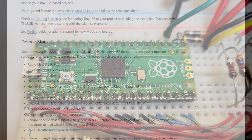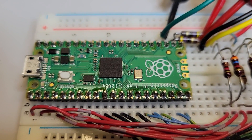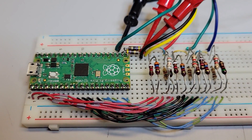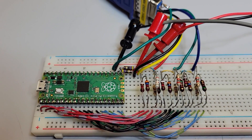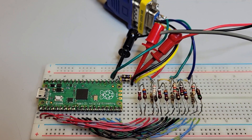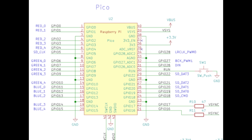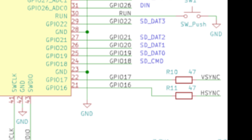I started by dragging out the VGA video breadboard that I built in Episode 6. For more information, please see Episodes 6 and 12 of the PIO Chronicles — I'll leave a link in the description below. As a refresher, the VGA video interface is a set of three 5-bit DAC resistor networks, one for each of the red, green, and blue channels. The horizontal and vertical sync signals are controlled by GPIO 16 and 17. I plugged the VGA cable into an old VGA monitor I had kicking around.